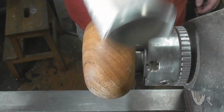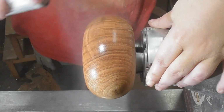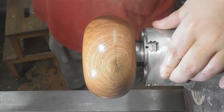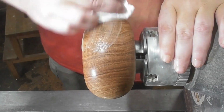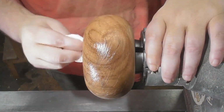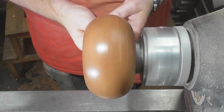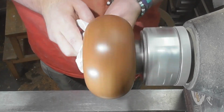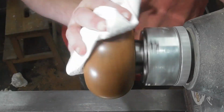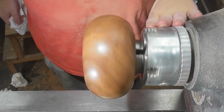Some matte sanding sealer. Some Yorkshire Grit Abrasive paste. You wipe this all over till you have a clean paper towel, and you have the equivalent of around about 1000 grit. There we go, just buff it in with your fingertips. You can feel that grit breaking down. There you go, last few wipes here. And there you go.